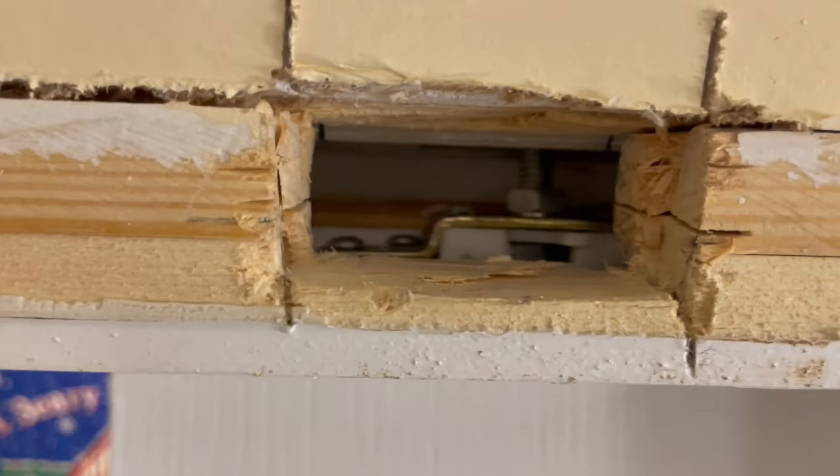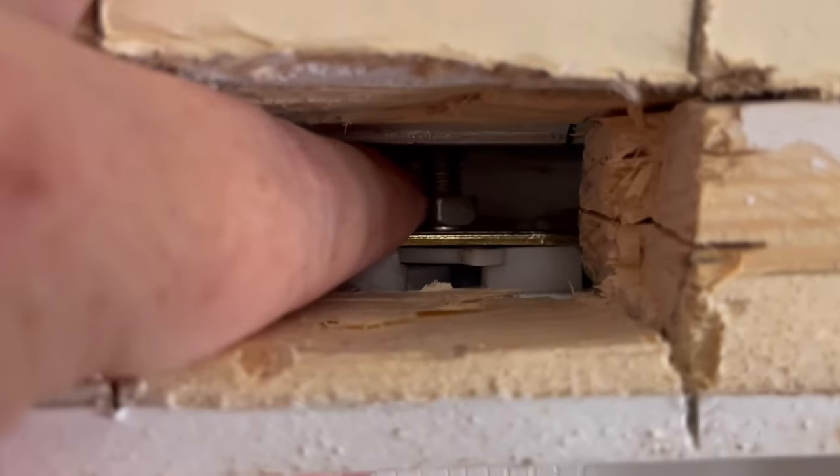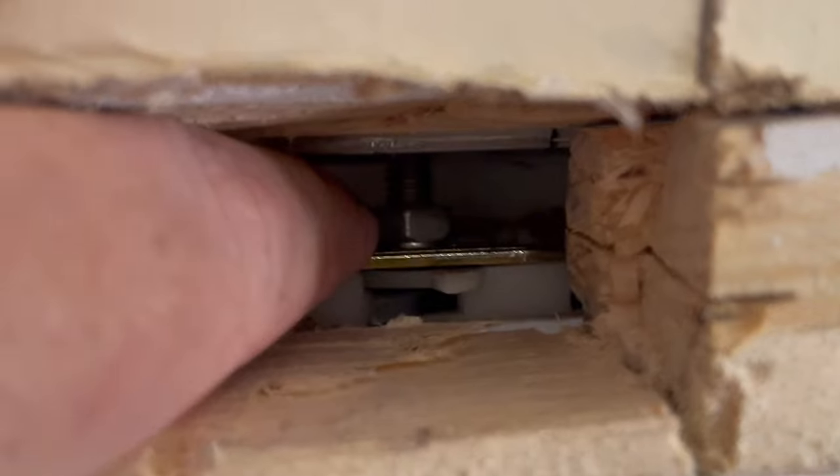Basically what we've got going on is up there in the roller, that wheel set has a screw in it, right? Well, it's got this adjusting bolt in it, and on the top, there's a welded nut. So there's really nothing to adjust up in that roller. It's just about adjusting this bolt head right here. That is not spinning up and down on this, but it is a fixed part of this bolt for adjustment. By tightening this up, the door goes up. By tightening it down, the door goes down.